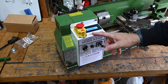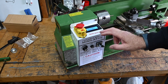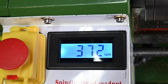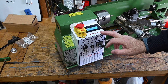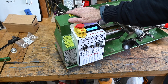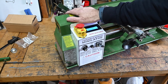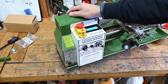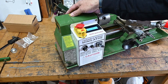I'm only getting a maximum spindle speed of about 372 or 376 since I put the new controller on and changed the motor. I did put a motor in there which is off of a treadmill, but I didn't really know what I was doing at the time and it's only a 200 watt motor.